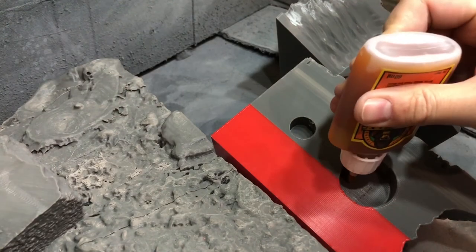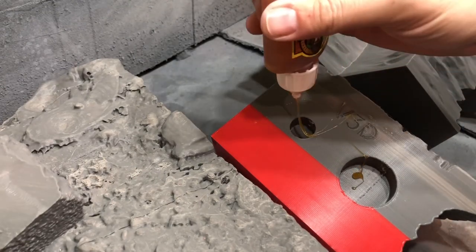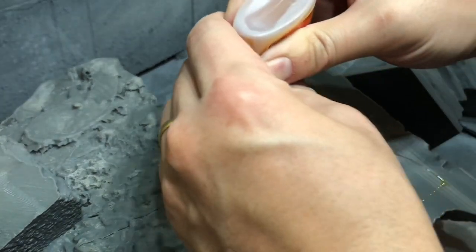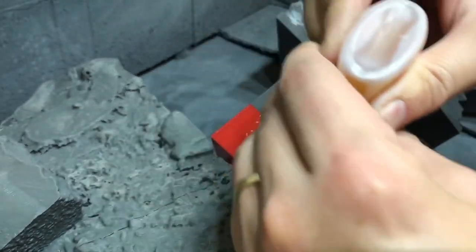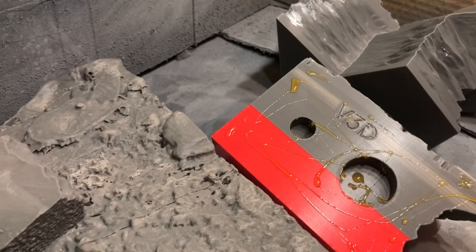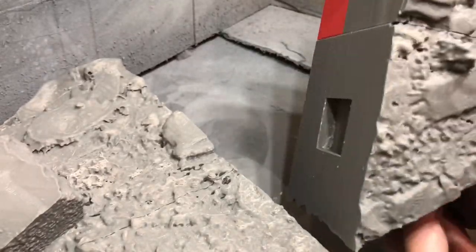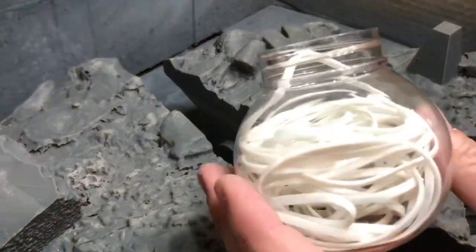The next step is quite obvious — you just need to apply the glue on the mating surfaces of your parts. You don't need a lot. Again, this glue is a PU-based, polyurethane-based glue; it does foam a little bit, I'll show you that later in the video. Don't apply too much, otherwise it can expand and create a gap between the two parts you're joining. Just make sure you cover most of the surface. This print is very good because there is no way you can put two parts together wrongly because of the keys — the way the keys were cut.